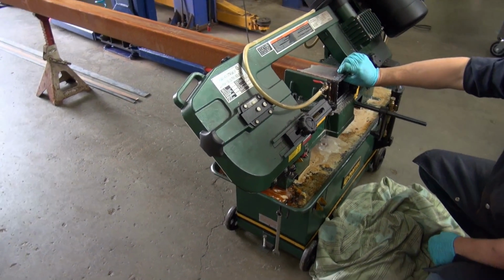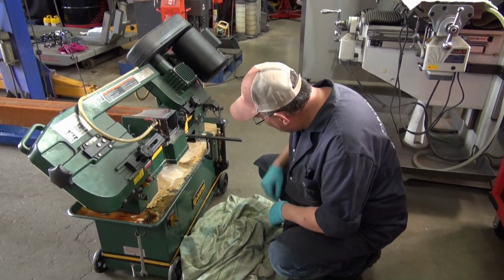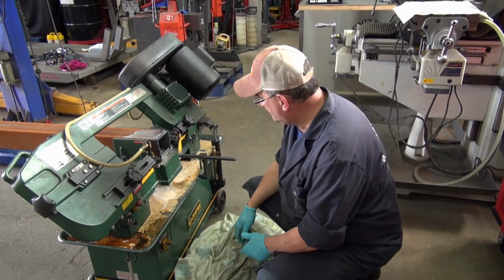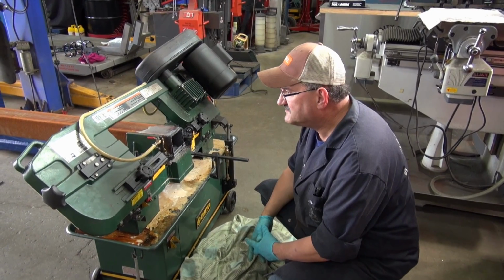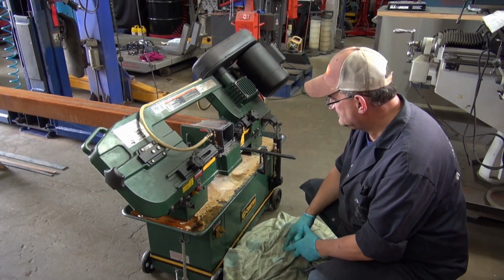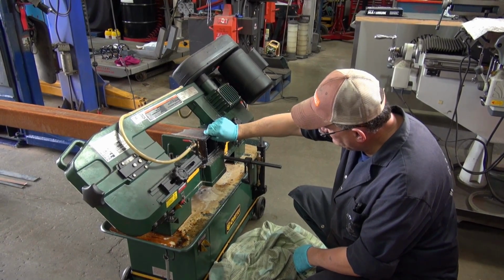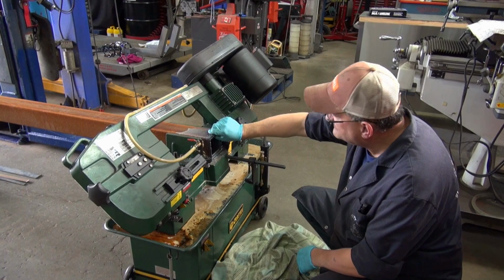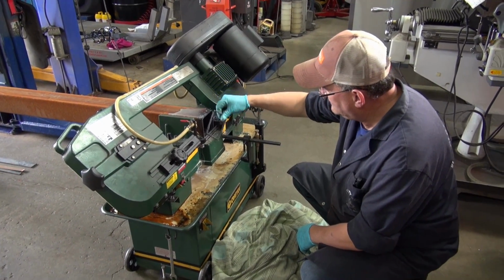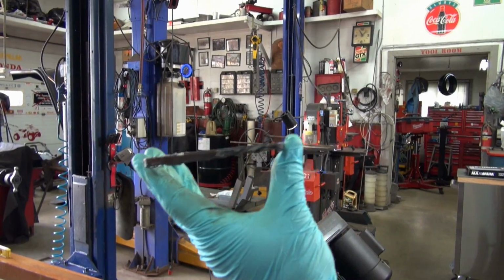We've had big solid round stock put through there, and go and have your dinner and come out and it'll be cut, right? Takes a while to get through maybe 4 or 5 inches round stuff. I think we can cut up to 7 inches. Yeah, 7 by 12. I think I'd rather cut solid than, yeah, so there's not much wastage there. That's good.